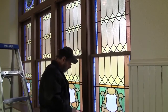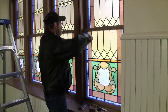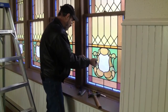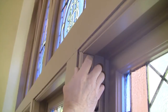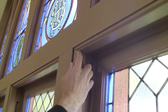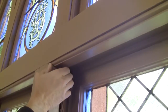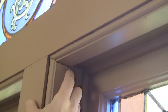Okay, now I'll take the flat bar. Pushing forward and pulling back and forth. It pulls out from the front, it pulls out from the back. The way they cut this miter, very unique, back 114 years ago, early 1900s, late 1800s, is that they overlapped the front. It was like a coping saw cut to match the front where they meet, to make it look like it was a miter cut in the front, but actually in the back, it's cut straight back.